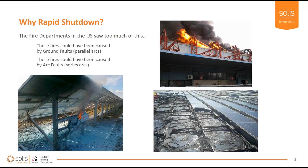We're here to talk about rapid shutdown, and why? PV modules don't appear to be very flammable, but actually they burn quite well. The EVA — the cushioning material between the Tedlar back sheet and the glass front — is very flammable. Even on a metal building with little burnable material, there can be a big fire from EVA burning. These situations could be prompted by a parallel arc fault, ground fault, series fault, or arc fault.